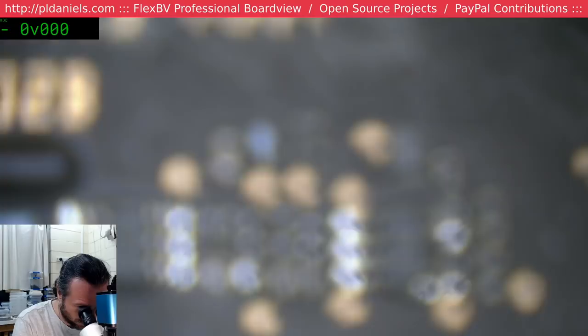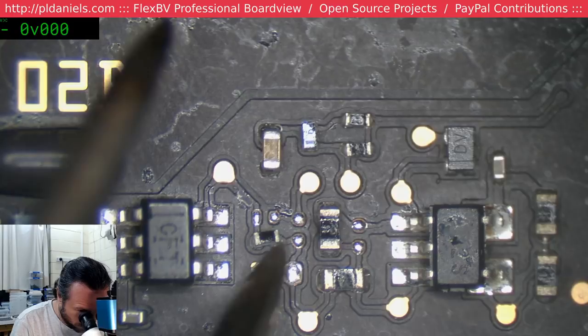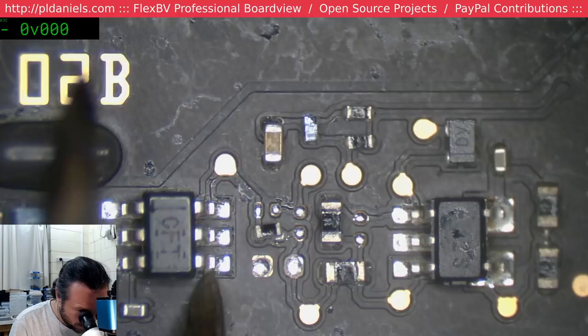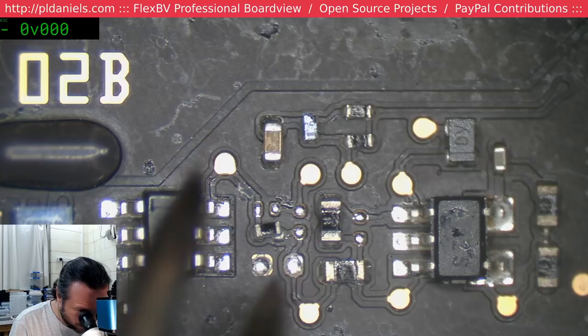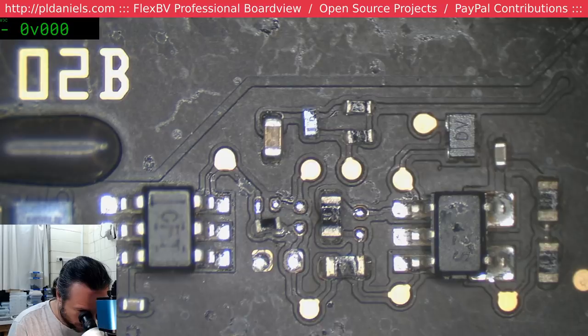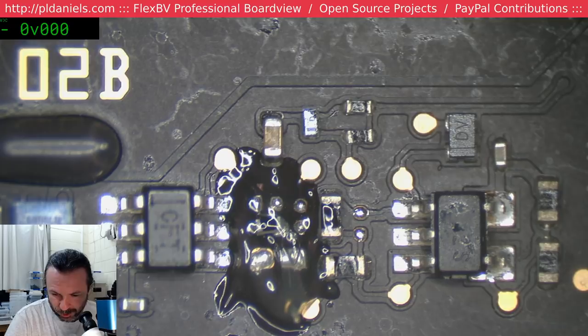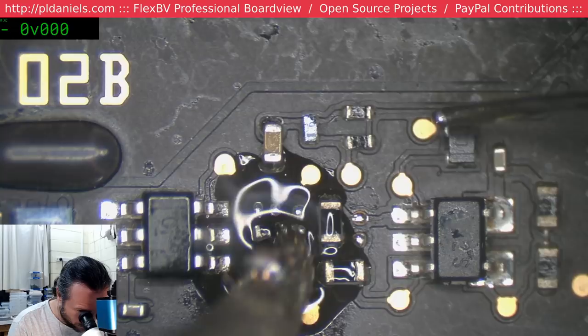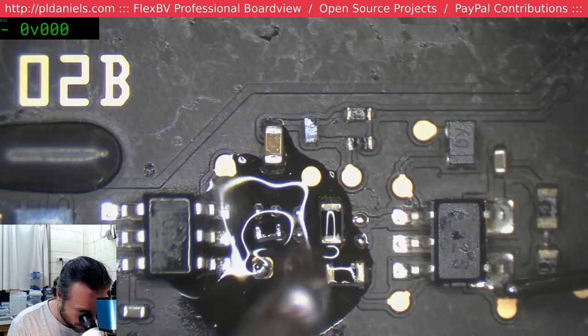now this here is a good example of a bad reflow out of the factory. This is suffering something similar to what we call a head in pillow effect, where, because of lack of flux, probably, just a bit of a bad paste laydown, the end cap of the part doesn't actually reflow properly with the solder. Thing is, things like that can often be your rabbit holes. I'll fix that up now, simply because I saw it. But something like that can be why you can end up declaring a board dead, simply because of a head in pillow type effect. Okay, well that's fixed up now.